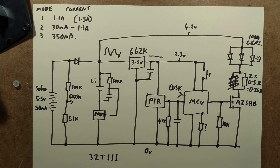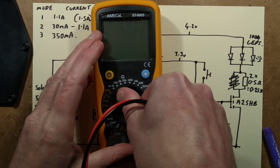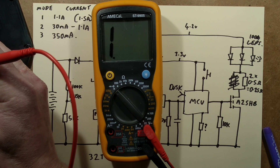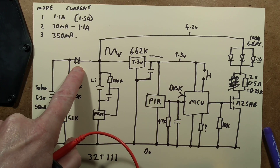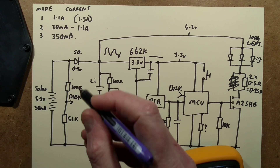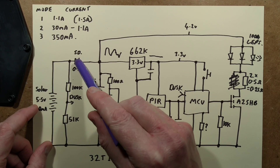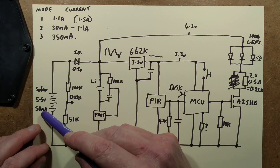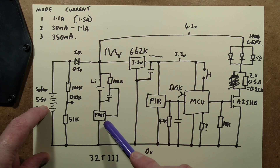It would be interesting to check if this diode is a Schottky. We can check that with the meter on diode test: if it's roughly about 0.6 volts it's an ordinary diode, but if it's closer to about 0.2 volts it's a Schottky. Yes — that's a Schottky diode, about 0.3 volts when pushed under current load. That's good because it means it's going to be more efficient than an ordinary silicon diode. There's a slight risk of a bit more reverse leakage compared to a silicon diode, but the advantage is that even as the sun is going down it's not going to deduct too much voltage off the solar panel — everything is optimised for charging the lithium cell.